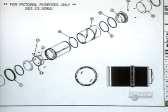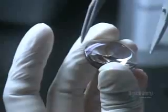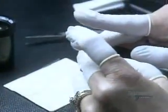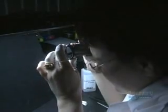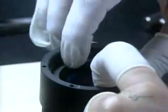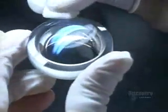They double-check the design for this complex optical system and begin to pull all the pieces together. This singlet, or single lens, goes into the metal barrel first, followed by other lenses with various curvatures and dimensions. She places metal spacers between the lenses to separate them — proper spacing will prevent aberrations in the image, such as blurring. Between installations, she covers the barrel with a piece of lint-free plastic, because eliminating dust continues to be a necessity. One fleck could ruin this entire assembly.